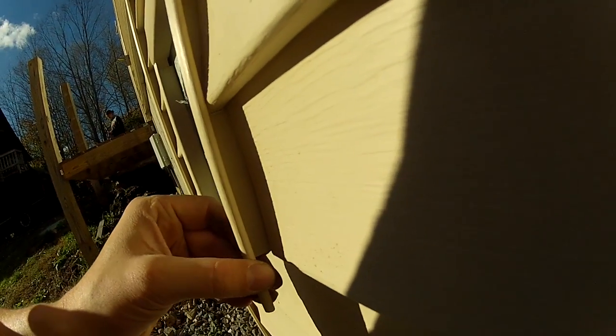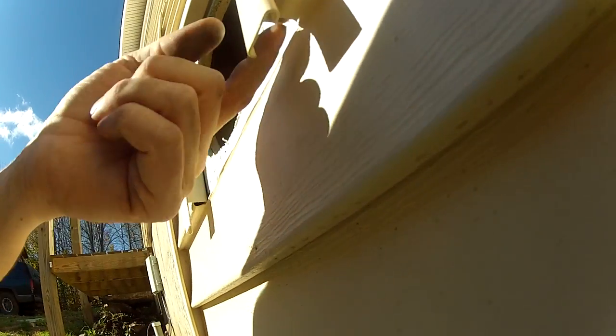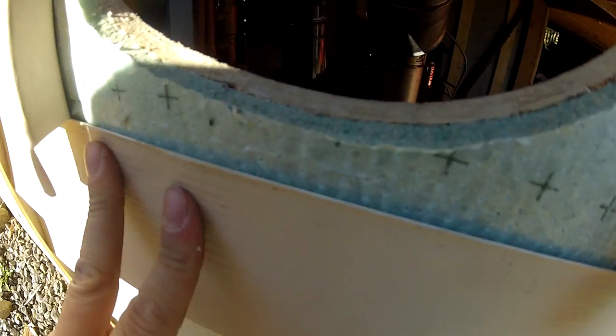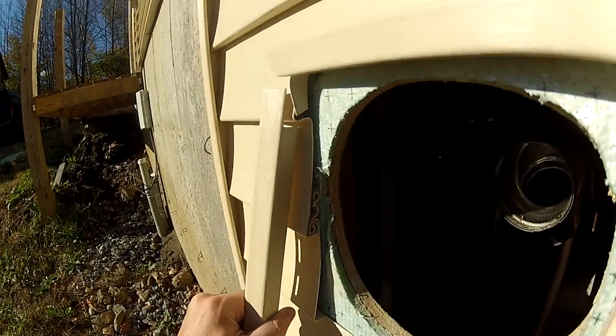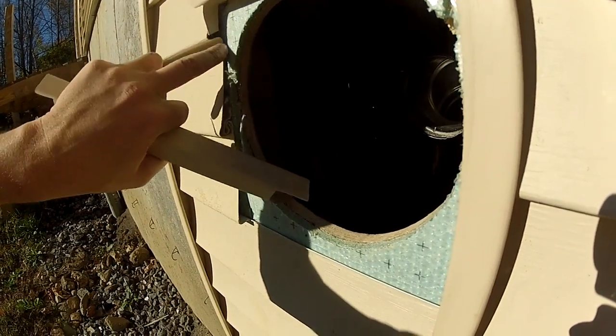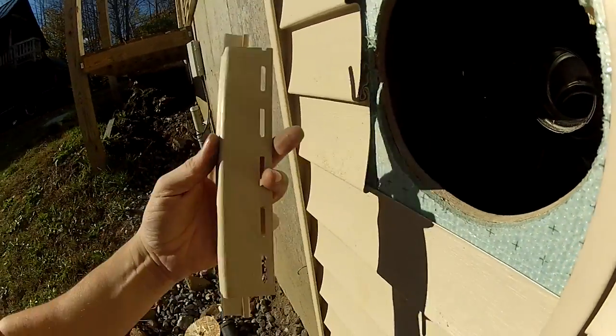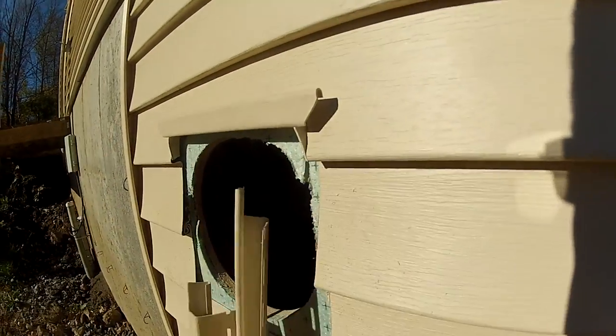Sorry, I'm talking really loudly. The only thing I'm worried about is the water going down here and then inside the siding. So I cut it out here so that it can drip down below. I'm also going to put a bead of silicone right here and basically attach that directly to the styrofoam — same thing on the other side. There's a little gutter piece that goes around. These I haven't nailed in, but you can see how that works — it just slides in and tucks up under there. I'm going to silicone all the way around, and use silicone as an adhesive to hold these here because I can't quite get in there and put a nail.